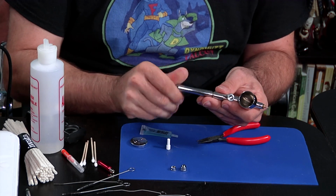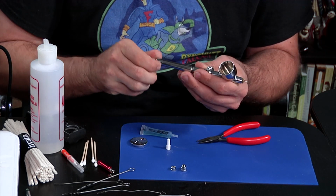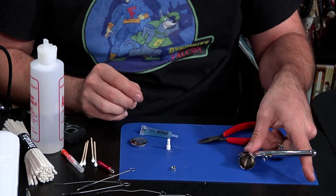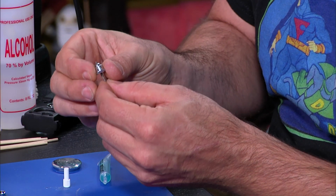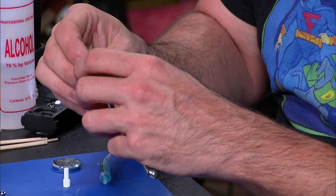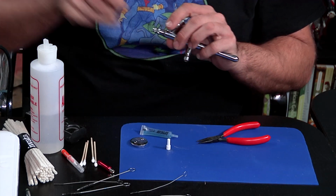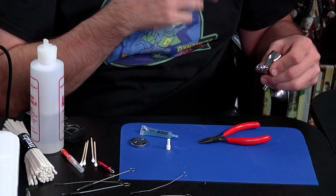Put that back on. And your two cones in the front. Yep. Small cone, then big cone. And the big one, again, you could take any of these little cleaning things and clean out the inside of it. And the same solvent can be used for everything. Yeah, whatever you're using. Even with the detergent-based cleaners, I'll usually run alcohol through the whole thing anyways.